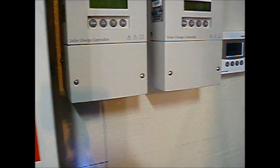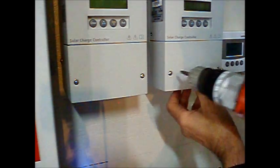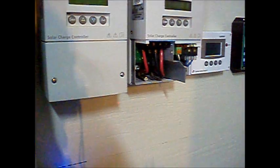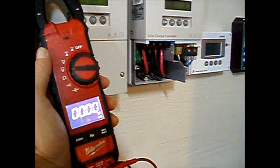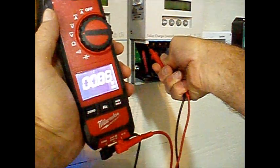After the timeout period has expired, remove the panel. I suggest the use of a voltmeter to check for the presence of voltage from the solar array — you may see a volt or two.